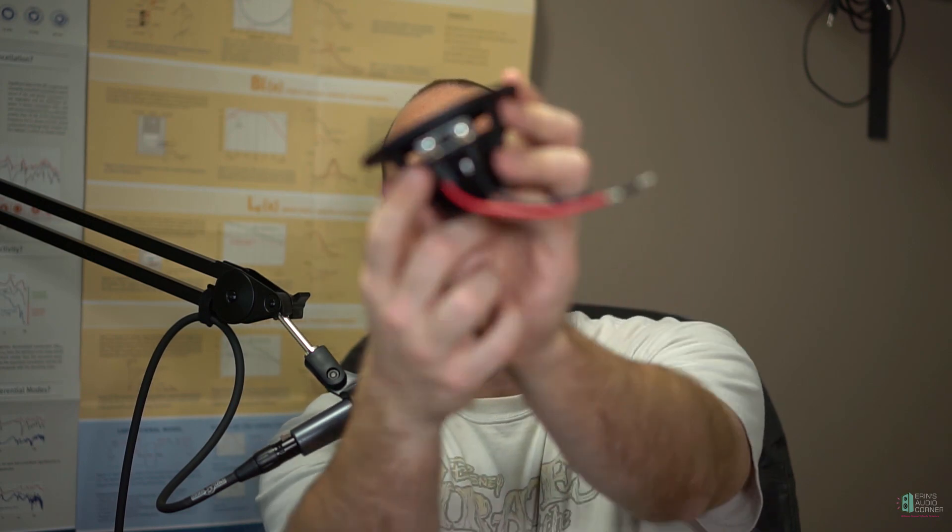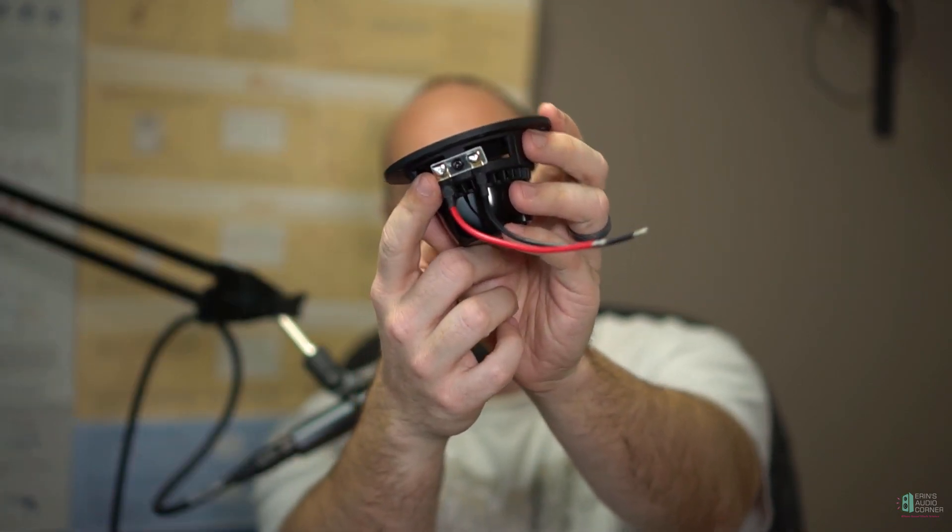One thing I want to point out: if you're like me and you tend to route out your holes a little bit smaller than the manufacturer specs, and then use a wood rasp to chisel away a little bit to get a really snug fit — be careful doing that with this particular speaker. Because it's so small, the solder pads are a little bit wider relative to what you'd have on a big subwoofer. I actually wound up routing this out twice. The first time I went smaller and sanded it out, and the second time I used the manufacturer spec and still had to sand it out a little bit to get the solder tabs to squeeze into place.